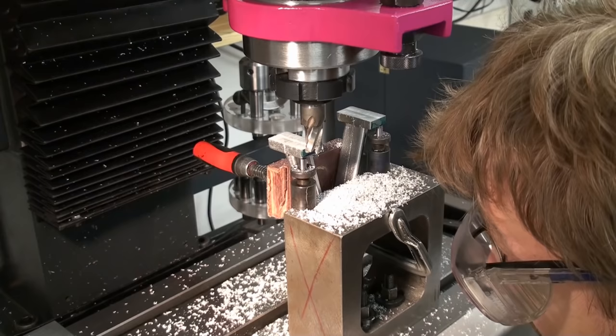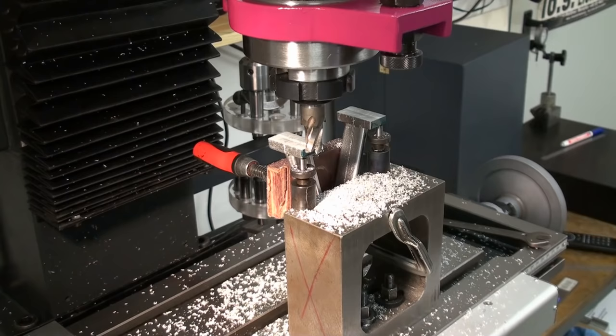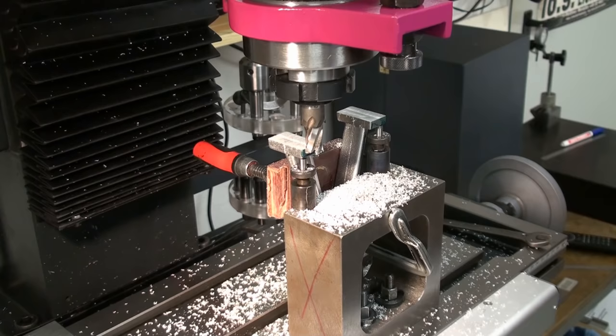And we're about a millimeter to go. Yes, I said about a millimeter because the top surface where I can measure to is a raw casting. So the overall height of this thing will matter later, but as of now, no problem. And another 5/10 of a millimeter.